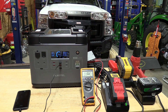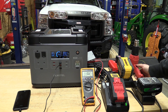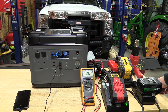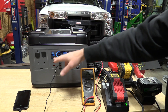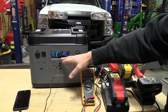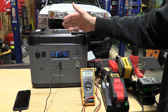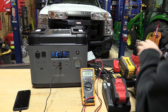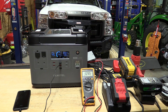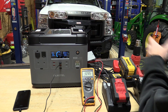We are at 432 watts out, and not much is changing with the volts. We can turn on our handy dandy solar power generator drainer. We're up to 1600 output watts without an issue — 30 minutes remaining as far as charge, which lines up with the 10 to 15% efficiency loss going from DC to AC. We'll try to do a quick test of the peak surge — turning on the heat gun to about 1400 watts out, then hitting the circular saw, which should take us over 2000 watts.